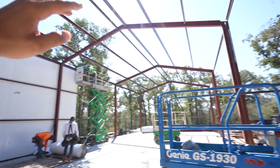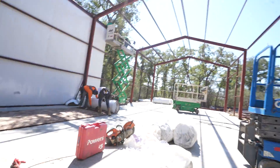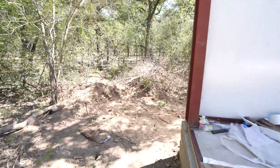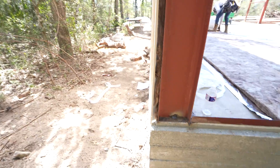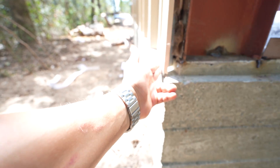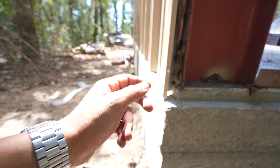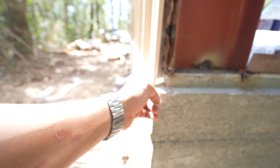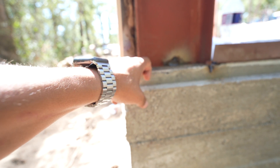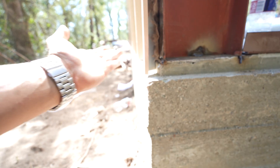It's actually a beautiful building — it's 16 feet tall, so it's really big. With the white walls it's just going to look very clean and open. This is a 3:12 pitch. Here's the notch work, and here is the panel that is overlapping. This helps prevent any critters from coming in and, along with the insulation, prevents water from seeping in. You can see we have about an inch and a half of height where the metal building sits and the panel comes down that inch and a half.